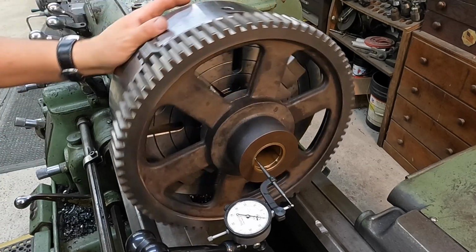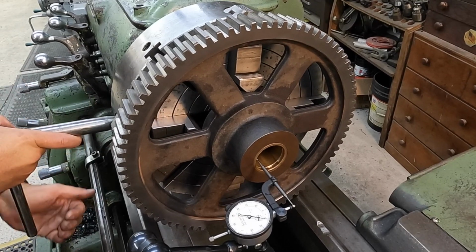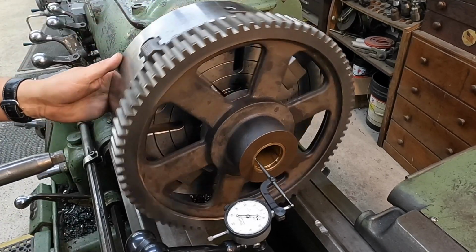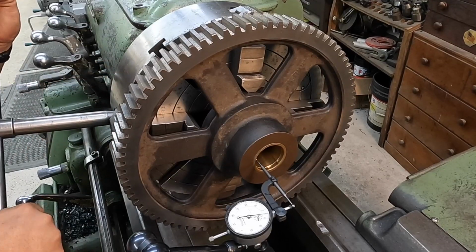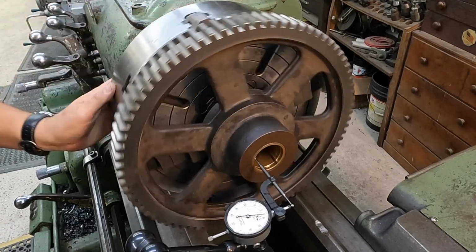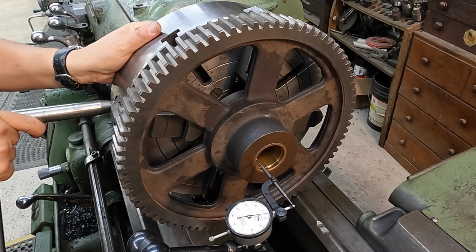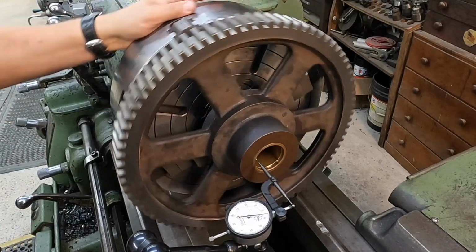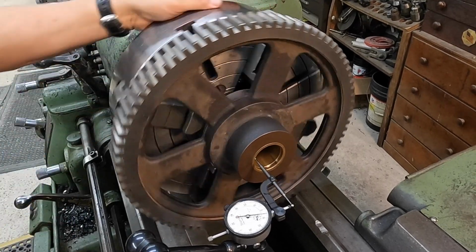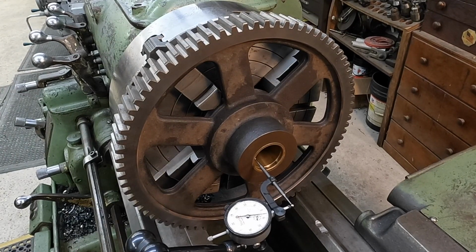Tighten the low. Make sure that it's snug. That's the tight jaw right there. One of those tight jaws is what will give you problems whenever you're trying to bump the face around. All right, so we've got about 2 thousandths right there. Let's hit this one here and this one here. It's 0.5 thousandths right there. See if I can get it out. That's pretty good. All right, back to the face one more time, and let's see if we moved it.